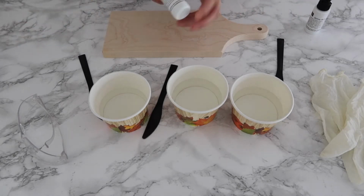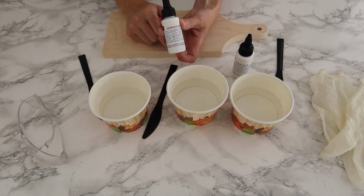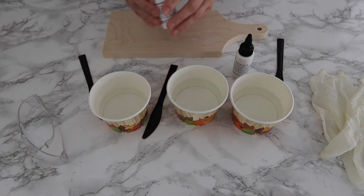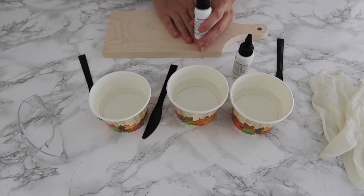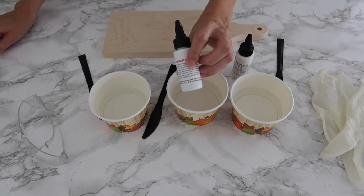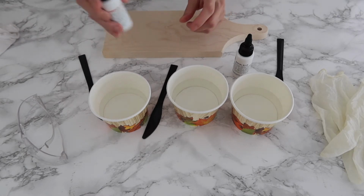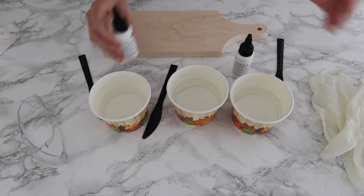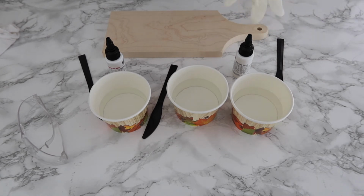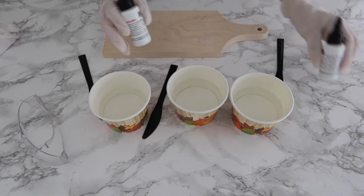The first thing we're going to do today is mix the alcohol dye product into a little bit of water. Okay, because this is a concentrate, they want you to mix it with something. Now, you don't necessarily have to. You can put this directly on the piece of wood, but you want it to flow a little bit, and you want it to be easier to work with. Because I would imagine if I put this directly on the wood, I wouldn't be able to wipe it. Okay, so I'm going to mix this in a little bit of water. It tells you instructions on how to mix it if you're curious, but the bottom line is you mix it to whatever strength you want it to be. And also, like I said earlier, I am going to mix these two to make a purple color.